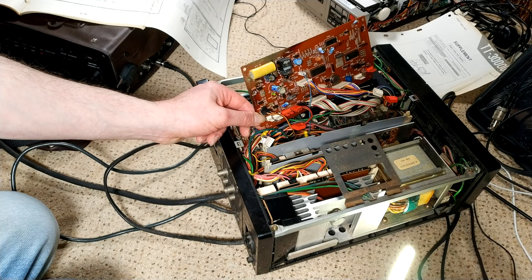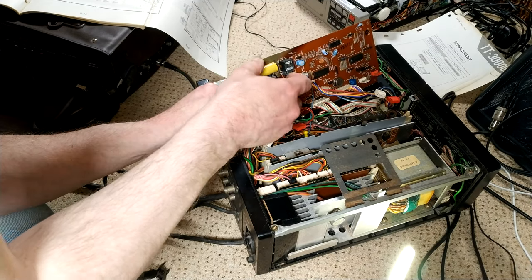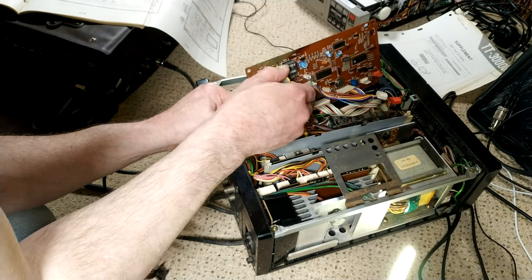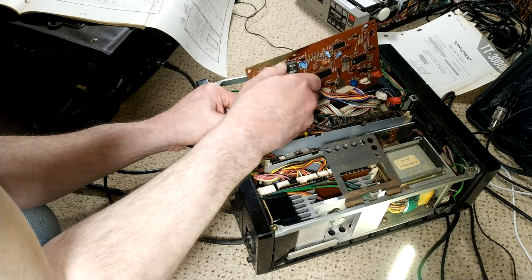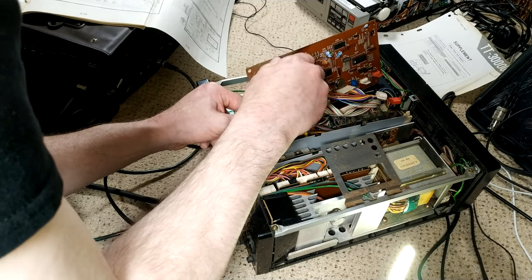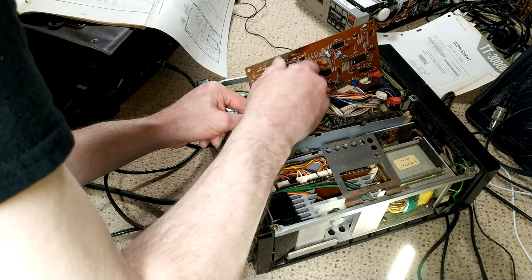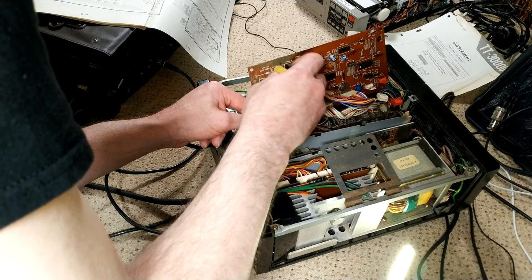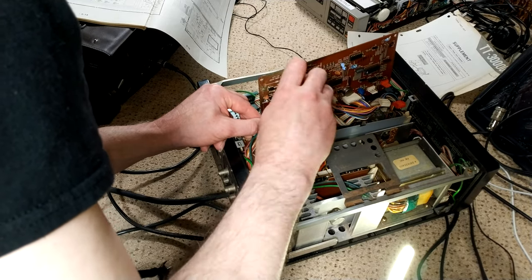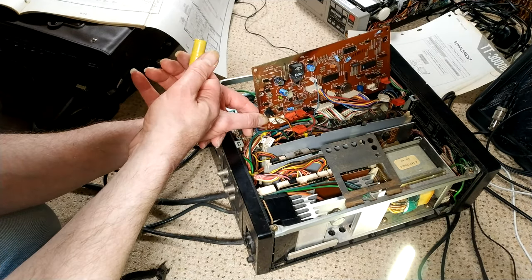Right, have you got the wire cutters, please? Please. Lovely. I don't know why I didn't think about the possibility of there being a backup battery. It's warm as well. So all the time we've been playing, we've been just gently cooking the contents of the battery out. Well, that was smart, wasn't it? I don't know. I think I just felt that there was probably a capacitor in here instead of a battery. So say there's a battery on the circuit diagram.